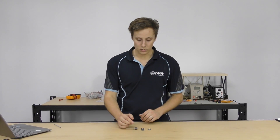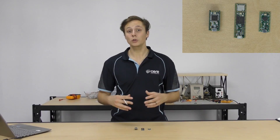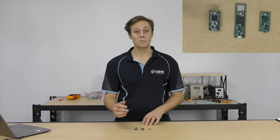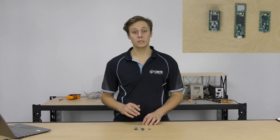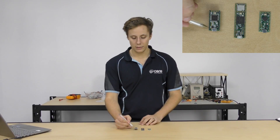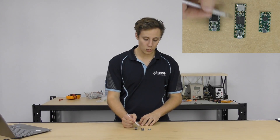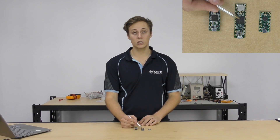To give you a bit of an idea of the power they're packing, this is sort of the next up from the base model. We've got the 3.2 Teensy here. They've also got the newly released 3.5, the 3.6, and the Teensy LC low cost. Even the 3.2 is running a 96 megahertz processor based on ARM Cortex M4. We've got the Teensy LC, the 3.2, and the 3.6 board here. The 3.5 and 3.6 were both only released in 2016 but the boards are actually exactly the same, just with a slightly different chip on board.